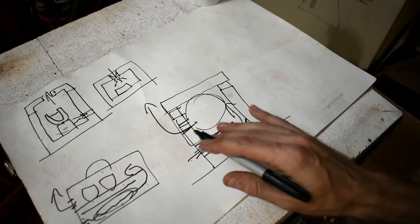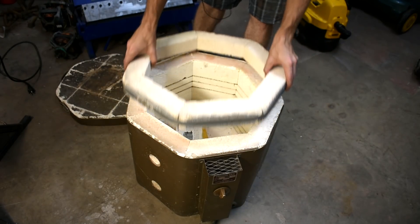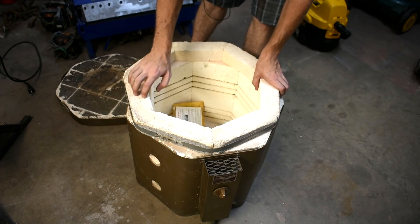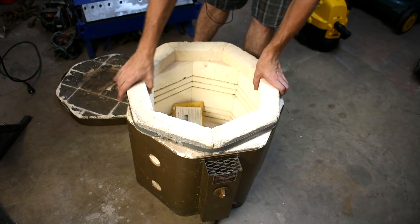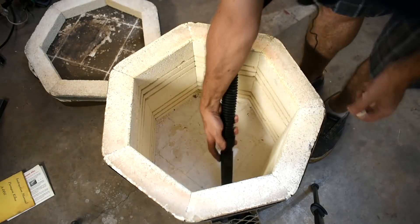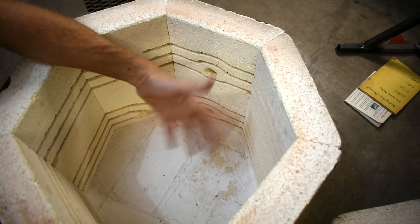Before we get to the burner though, let's worry about this. We got this lid — it's very lightweight, it's a bit crusty looking but I'm sure it'll be fine. This ring is something people get to make their kiln a little taller. I believe these bricks are different from the fire bricks I used for building the heat treat oven or the casting furnace — these are even lighter. I use light fire brick, but I use much higher temperature ones and I suspect these are the normal ones. And it is dirty in there. See these holes — this is where the plugs were so you can look in and check these cones. They have these cones that bend to tell you how well cooked everything is.